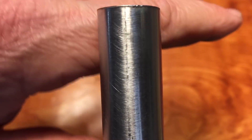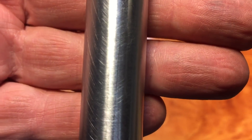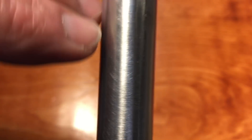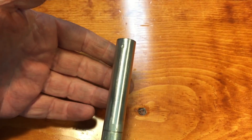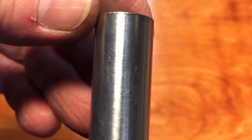Now we took this over to the sandpaper — that's a 320 — and we just roughed it. But now look at that: those are very fine scratches, nothing you could feel. If you felt it, it felt smooth as silk, and if you look at it from a distance, it looks pretty shiny. But when you look at it real close, you can see those micro scratches — that's what buffing gets out. That's what gives you a shine. You can see there's no reflective shine on here, just a little bit. From a distance it looks good, but up close you can see those micro scratches. Now we have to use a polish — that's where I'm going to take it to the buffer and show you how that works.